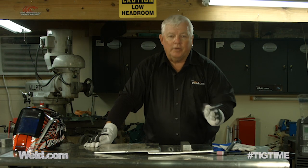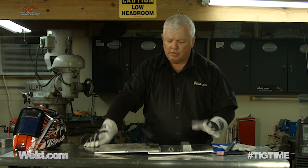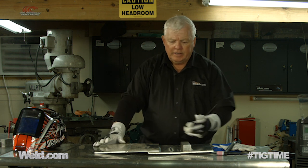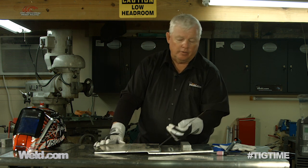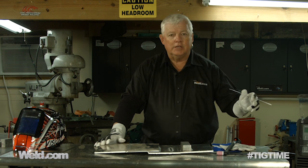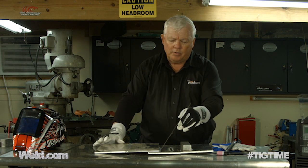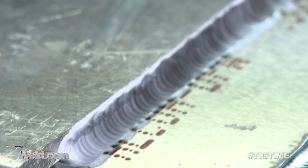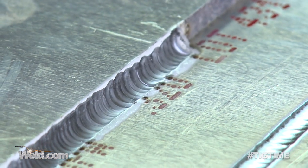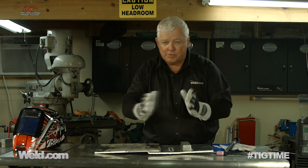I did three different welds, and I just want you to know that this metal has a lot of mass to it. I took two plates — they're three eighths inch thick — and started off cold and did a lap weld, which is really a fillet weld. I wanted to test the guts out of this machine, so I set it on about 250-260 amps and did this weld right here, and it was barely enough amperage with a cold part. Then I went to a bead on plate and just wanted to see the cleaning activity — how much cleaning from one side to the other, and whether the adjustments are accurate.